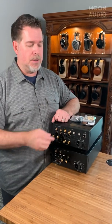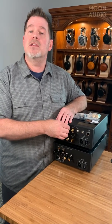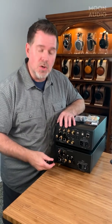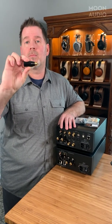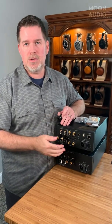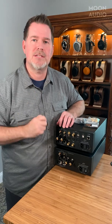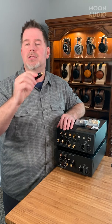AES and SPDIF outputs: SPDIF is normally RCA, and AES is XLR. Let's say your CD player has an XLR AES output and your DAC, like this LENA DAC, only has SPDIF RCA inputs. You can't just use one of these adapters — you've got to use an adapter that has a transformer inside to convert the impedance from 75 ohms to 110 ohms. You can't do that with a plain adapter, and you're going to destroy the sound of that digital signal. We've got different adapters for that by a company named Canare, where they actually put a transformer in to take care of that situation.